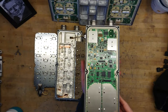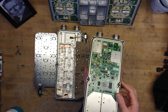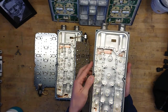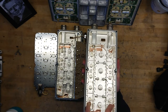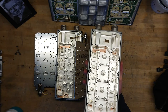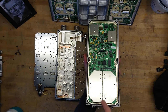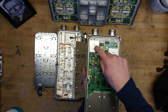The backside is quite interesting — I thought I saw all the ADCs on the board in the middle, but apparently there is some sort of first-stage filtering here. The output from the two receiving channels goes down through to the other side of the board. We have the input from the two antenna connectors here, and the transmit channel sits in the middle. The two receive channels go into each of their amplifiers — output amplifiers or filter stages — and there are also some smaller measurement circuits.